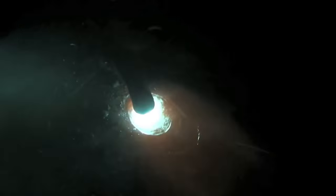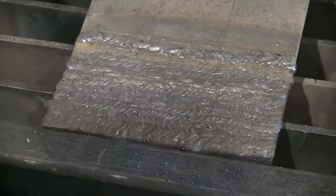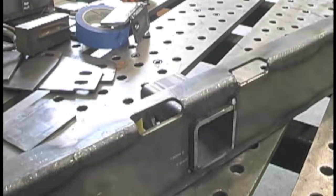Some different settings for trying to achieve the MIG-like TIG look, like ZT Fab on Welding Web — worked on that and dialed it in. Also some padding beads with 6010: techniques there, swapping hands — left hand, right hand, going right to left. Two steps forward, one step back. Kind of a pause, whip, and pause technique. That's a really good exercise for when you're in welding school.